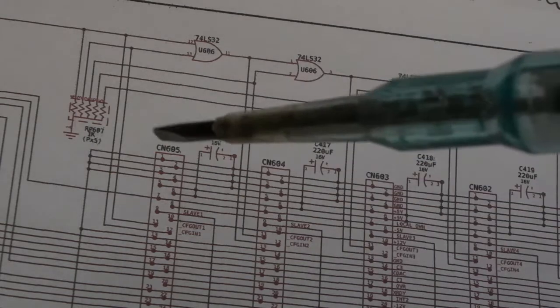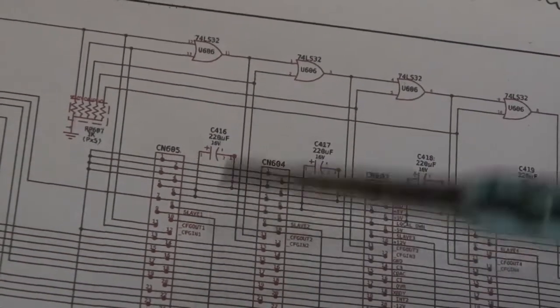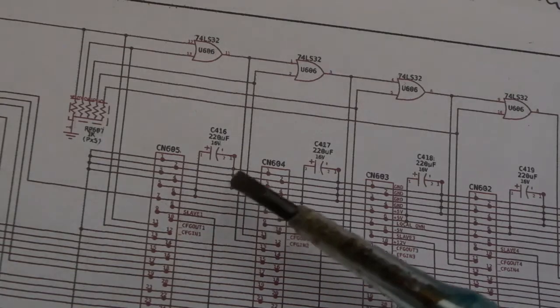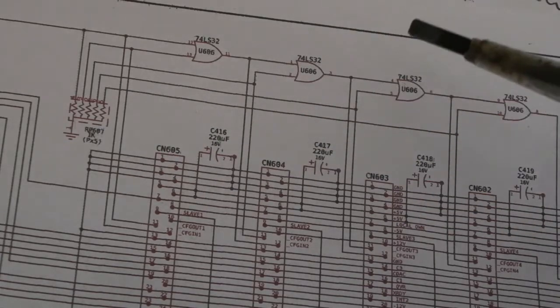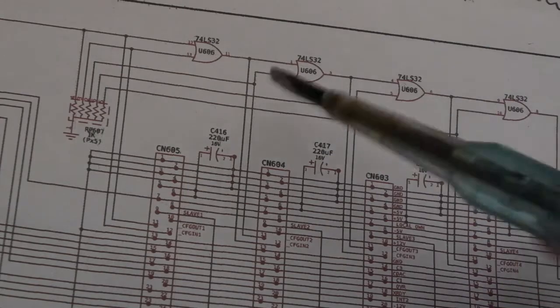I'm a memory card, I'm a hard disk controller, I've got a ROM or whatever. And the size, for example, so a memory card might say I'm 4 megabytes, where can you allocate me, where can I fit? I think that's how that works. In any case, it's written to that address. The CPU then processes and reads from that address and goes, all right, I know what I need to do with you, and responds to it.